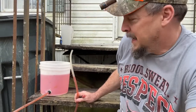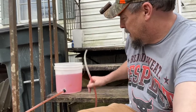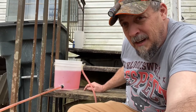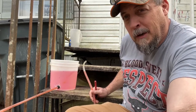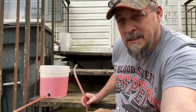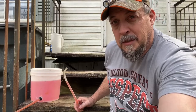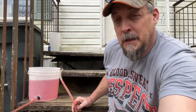This will allow you to go as far as you want as long as there's no bubbles in your hose. I have a 100-foot hose here. I have my bucket — the water level — at the bottom of that step, so if there's any leaking I'll be able to detect that the level in my bucket is going down. You can see that water is even with the bottom of that step. I can take this hose wherever I want around the bottom of this mobile home and measure with a ruler in inches — much more accurate than a laser level that has to be calibrated every couple of uses.